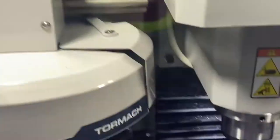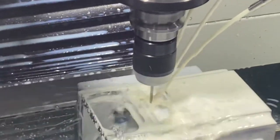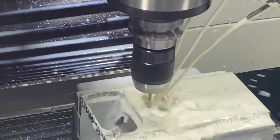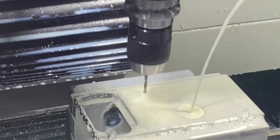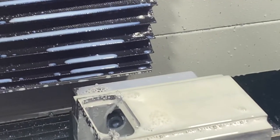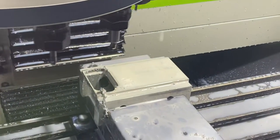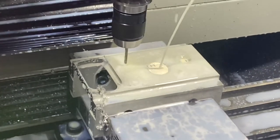Now I got a drill cycle here. This part's all pretty easy. May have to start adding some camera footage from the GoPro I've got in the cabinet. This is doing peck drilling — just doing it at five inches per minute, it's pretty slow. Hopefully that worked. The coolant is turning on and off the correct way, just adding M08s and M09s in the right place in the G-code.